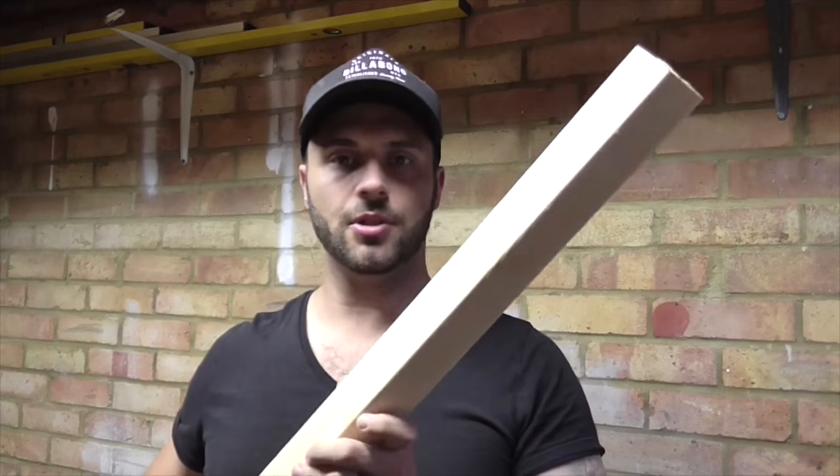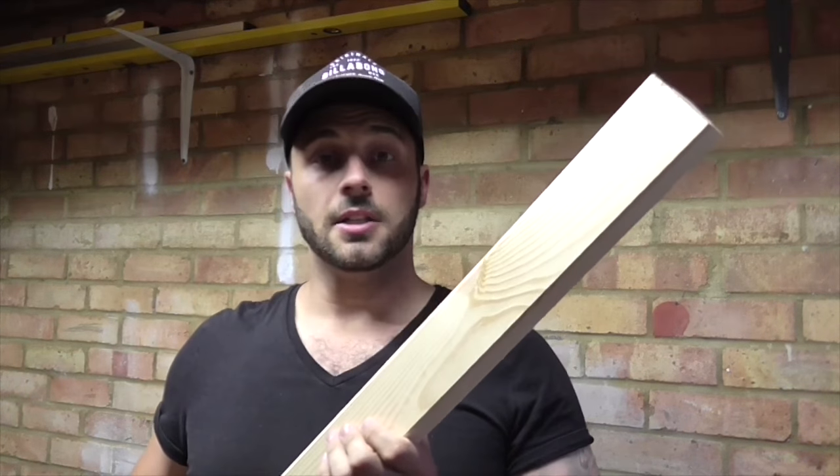The wall I've got here is brick, which means I'm going to have to drill some holes and put some plugs in the wall. I'm going to use the red plugs that take a 6mm hole. I'm going to drill them all the way along the wall through some CLS timber, mount the CLS timber on the wall, and then put a hinge on it. This is the timber I'm going to use to secure the table to the wall — it's CLS timber from Homebase, only £1.95 a length. It's a 2.4m length, so I've got to cut 60cm off it.